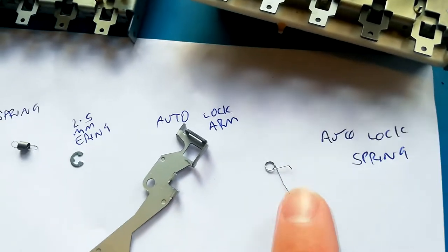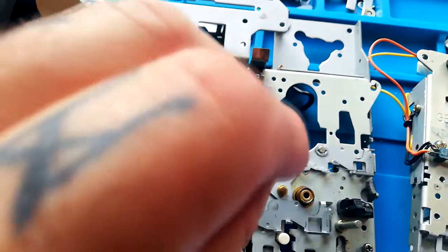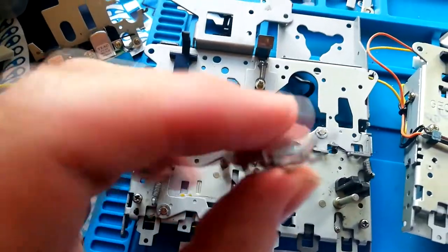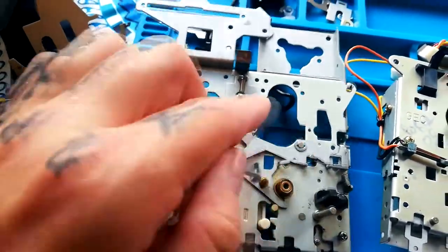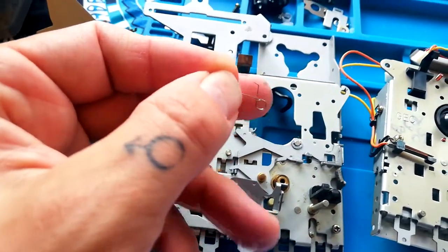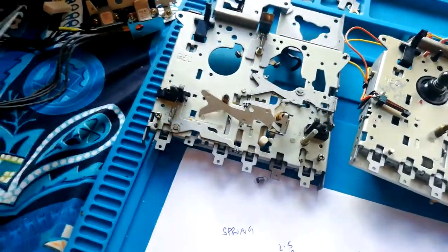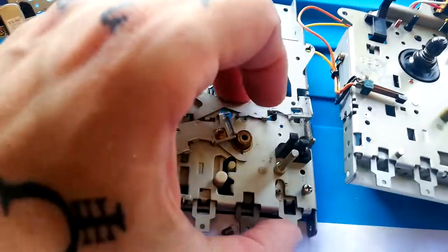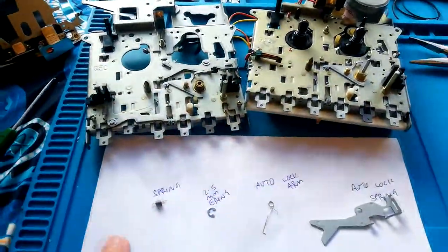Comparing it with another unit, you can see the long arm's crook goes through this slot — the same slot as one end of the spring — and the shorter end catches against this tab. To reassemble, start by putting the curly bit in the center over the central tab, slot in the longer arm first, then use a tool like the end of tweezers to get the other arm in place. When putting it back, that spring must sit on top of this tab connected to the pause lever, because that spring is partly responsible for making sure the pause returns into place. That's your before, your after, and the parts involved.